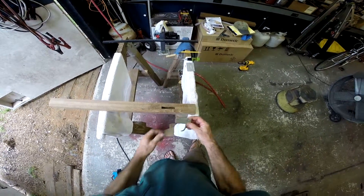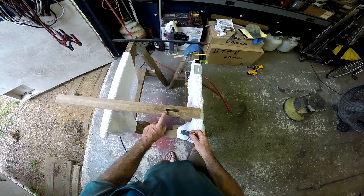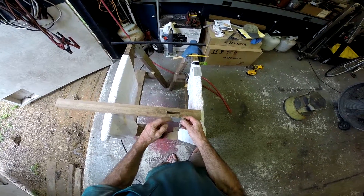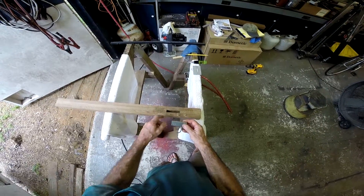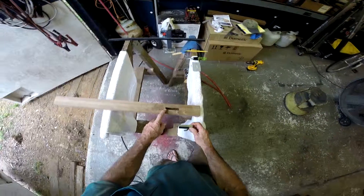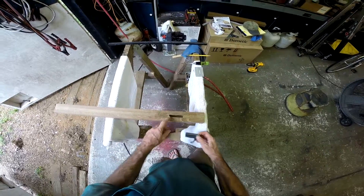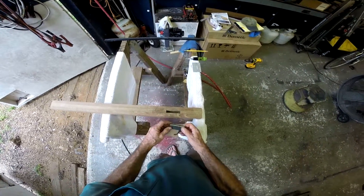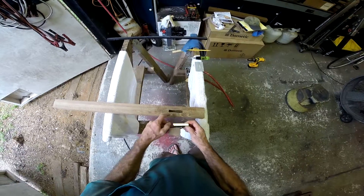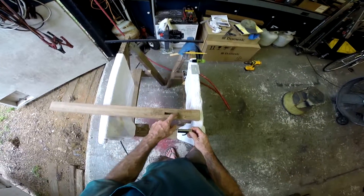I got the trigger set and I just want to show you a few things and a couple pointers. I use a standard handheld router, and the trigger needs to be set one inch deep — well, I actually set it about an inch and an eighth. I set my router bit about an inch and an eighth maximum, so you have a little bit of leeway. If you're doing a closed muzzle, it's gonna have to be set deep so you don't wind up bottoming out. What I do is, if it's an inch and an eighth deep, I router a half an inch first — you've got better control that way and it doesn't tend to snatch around on you.